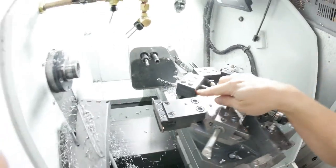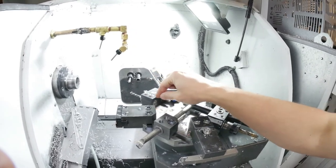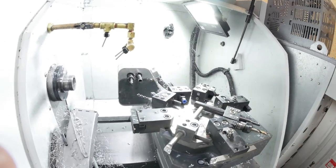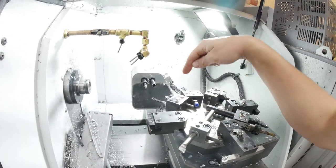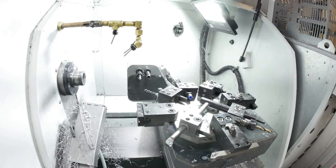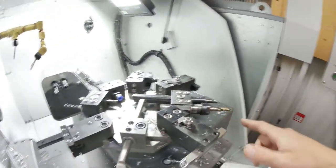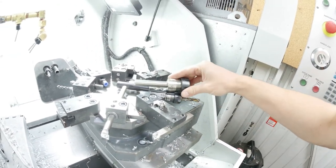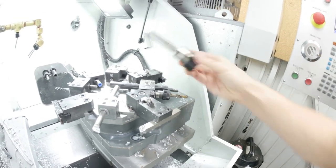Originally I machined these little holders myself, but the problem was the nuts on top don't engage all the way down to the tapping tool. I used a little screw inside that basically pushed down on it too — not the best solution. So what I'm going to do is machine some collets. Luckily the shaft size on the back of this is the same size as this holder. The annoying thing is I would have bought that holder had I known it was this long.